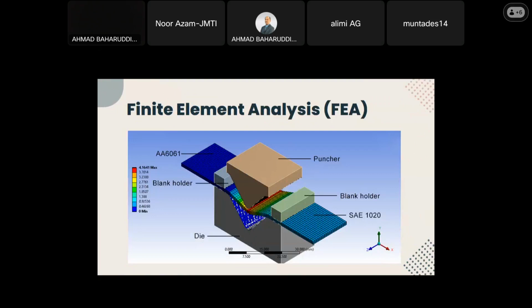Finite element analysis was done for the V-bending test. Modeling was done using SolidWorks, while the simulation was run in ANSYS. There is a clearance of 0.05 mm between punch and plate to avoid localized compression. The 2 plates, although separated, are combined as one part so that it will be a conformal mesh.